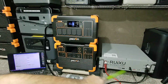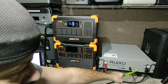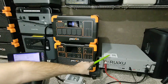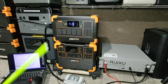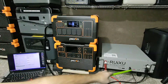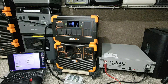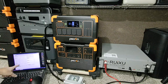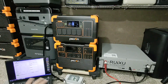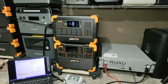This server rack battery doesn't have any screens other than the SOC — state of charge — the run indicator, and the alarm. That's all you really need. It's set to master one, which means it's a battery all by itself. If you have one of these, you can monitor it via a laptop through a communication cable — about five bucks. You can set all kinds of parameters, but be careful — messing with them can be very dangerous.